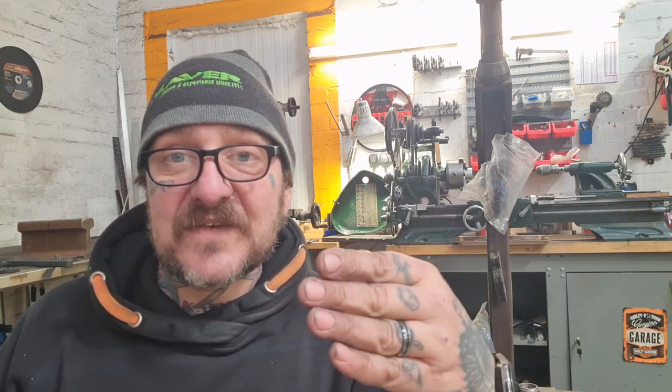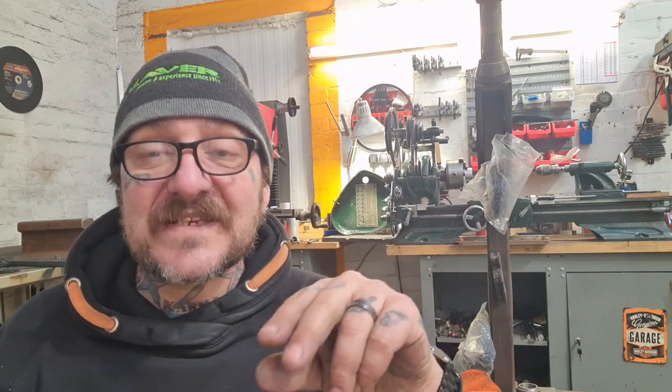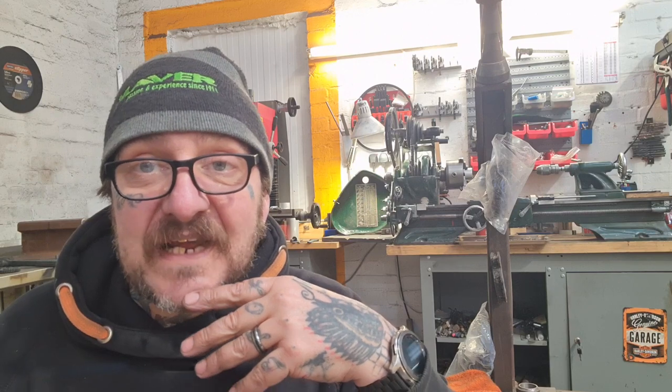And I've learned to angle my compound to the left when you're cutting internal threads. That was one mistake. Check my tooling is going to fit. That's number two. Check your tool is actually going to cut the profile, because a thread cutting tool is a profiling tool. Make sure that it's going to fit. I've learned that. And really, most importantly, number three, make a test piece.